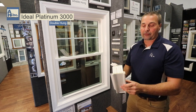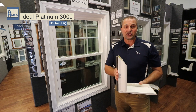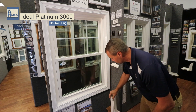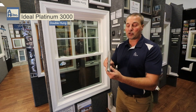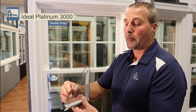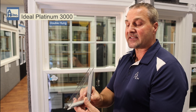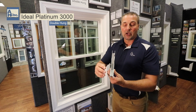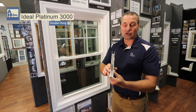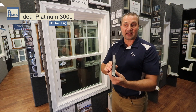When we go back to the frame of the three and a quarter, it will have a foam wrap on it, and it'll also have shot insulation if needed. The glass on the window standard is double pane, meaning two pieces of glass. Double strength means it's very thick. Most people sell single strength, and the ESM Plus package comes standard with two coats of low E and argon. The thickness of the glass helps stop any type of stress cracks and conductivity. The argon helps the glass perform for its U-value, and it comes with a super spacer inside the glass.